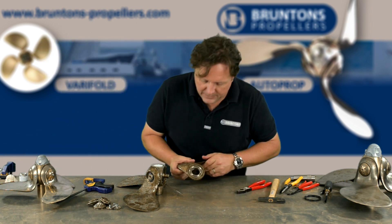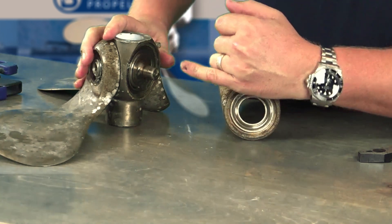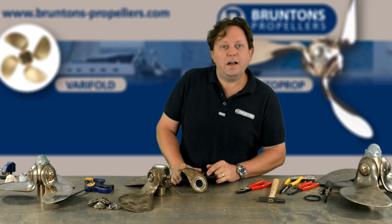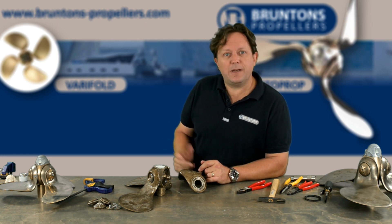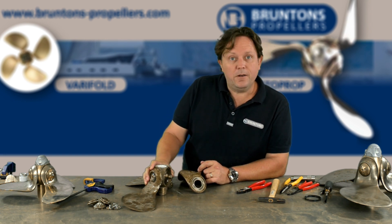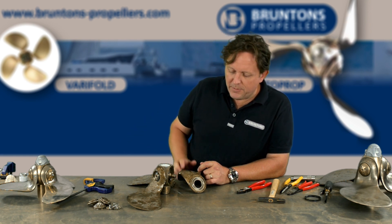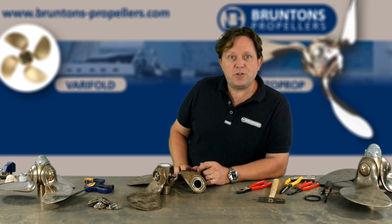What we're looking for now is to check the tracks — the races — for any marks or wear patterns. With the H5, it is possible that these could wear. In that case, there is some remachining that can be done but it has to go back to the UK. Just check the races, make sure they're smooth and clean. If there are any marks, send a photograph and we can advise whether you need it remachined to restore the bearing tracks.